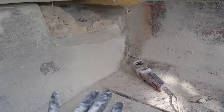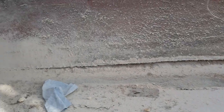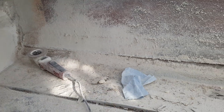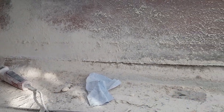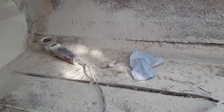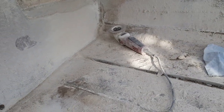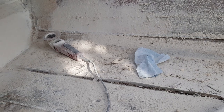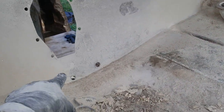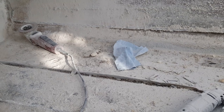The transom is cleaned up and ready to go. Before I start mixing new material and cutting wood, I'm going to finish grinding the rest of the stringers. There's a lot of dust everywhere and this is only after working in the back of the bow. If you can, rather than using a water hose, it's probably easier to use a dustpan and broom — it helps manage the excess runoff going through the drain hole.